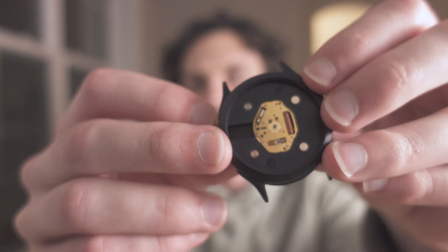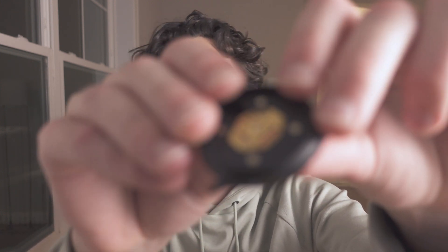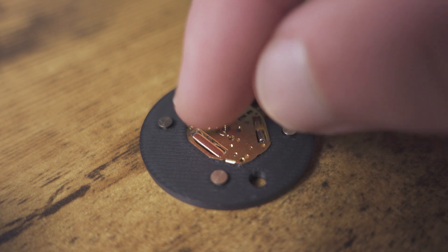I'd want to put the stem into the little groove that I designed. You put the main part of the case on first because there's a hole — that is where you slide the stem in. And then you put the hands on and the crystal gasket and the crystal, and you put the watch crown on the stem, and then you have a working watch.